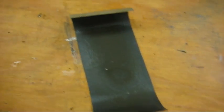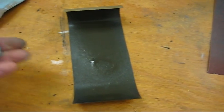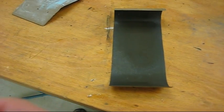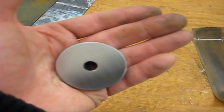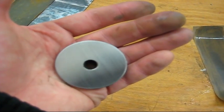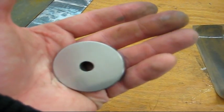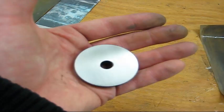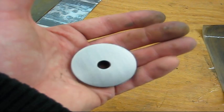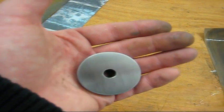So now I'm over to 600. I'll get back to you. Here's the sanding with the 600 paper. It goes faster, and if you do it properly in the first steps, the next steps are faster. So this didn't take more than maybe 2 minutes.